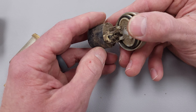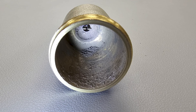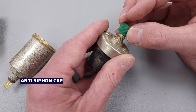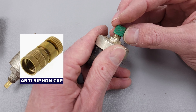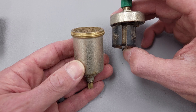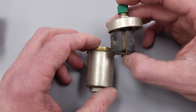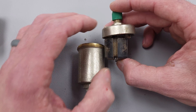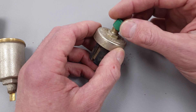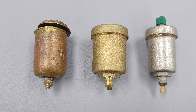Here's another one — as you can see this is very dirty and really needs to be cleaned, otherwise it's just going to be seeping water right out of the top. Also, instead of a regular cap you could have an anti-siphon cap put on it. You have to think about where the vent is installed — if it's in an area that's low in pressure at some points, it may even pull air in instead of just letting air out. You can get a different style cap that allows air out but not air in.